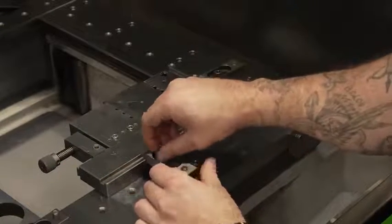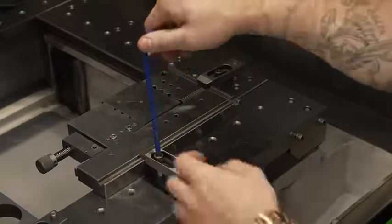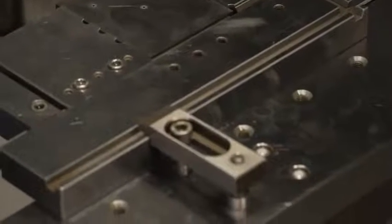Tell me all about the specification. Yeah, so the spec of the machine, this is a 4-cut machine, so we'll be going down to sub 0.3 Ra on a good quality tool steel. And again, we can accommodate between 0.1 and 0.3 wire as standard on this machine.